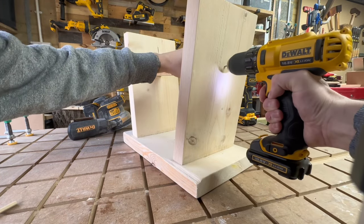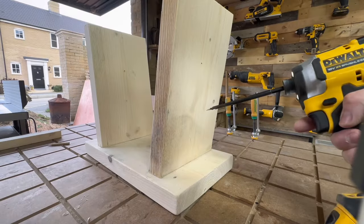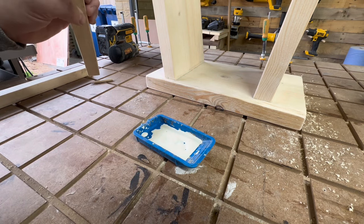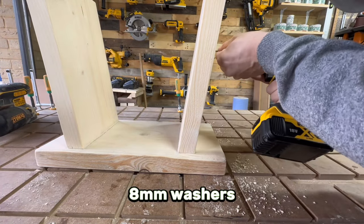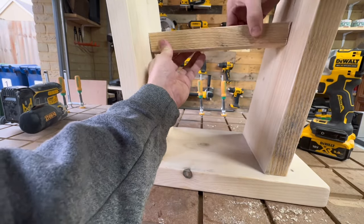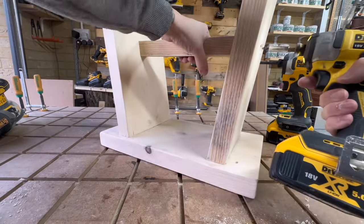Now I drill back through the pilot holes and into the stretcher — this gives us a mark where the screw will need to land. Same as we did earlier with the stool top, I'm using the 12mm spade bit to drill halfway in for the countersink holes. Glue the ends of your stretchers, remembering it's end grain so double up the layers. I'm using one 8mm washer here as the 12mm anchor we did earlier is not necessary for this section. Drive your screws through until they just stick out the inside of the stool, then align the pilot holes in the stretcher to the screws. Now drive the rest of your screws into the timber — hold the stretcher with your hand to stop it spinning as the screwdriver bites.